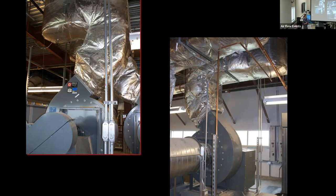These are some preliminary pictures. You'd be, oh, I'd never do that. But I'm almost sure you're going to run into a system effect problem one way or the other. As a matter of fact, every fan has system effects that happen to it. The only time that becomes noticeable is if you haven't estimated enough static to overcome the problem, or if you have something in the system that you hadn't foreseen before.